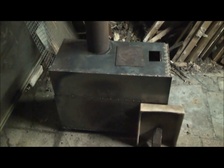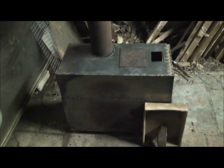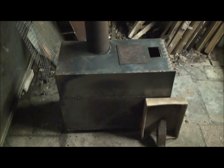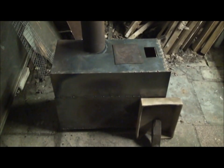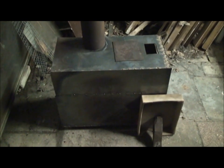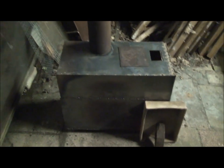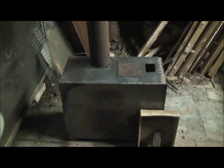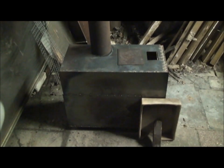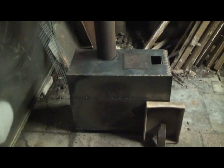Overall I'm very pleased with that little experiment. I'll probably finish the boiler — the water jacket — find all the pin holes that are leaking, weld them up, reassemble, line the firebox, insulate the riser tube, and see what temperatures we get. When there's 700 to 800 degrees hitting that water jacket the water is going to get very, very hot, very quickly — and I don't know if that's a good or a bad thing. It could potentially heat the water too much.